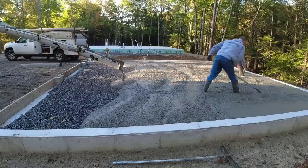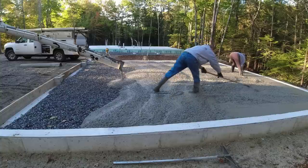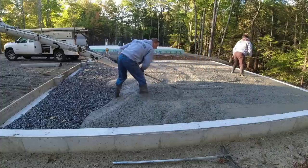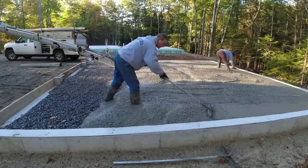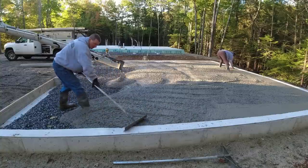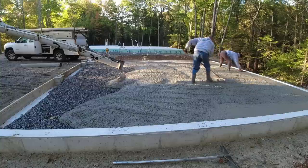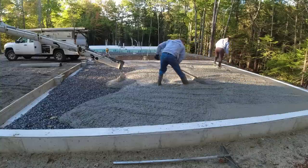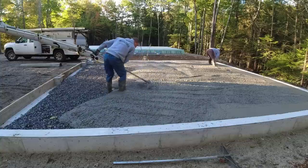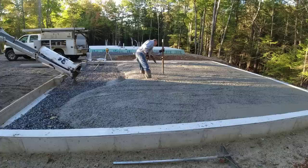I'm getting about two-thirds of this poured out before I screed it. I want to make sure I have enough poured out so I can get the first half screeded all at the same time without having to stop. Once I dump a bunch of concrete on the ground, I'm tuning it in with my come-along — a lot of you guys call them rakes, it's basically the same thing. I'm trying to get it as close as I can by eye to the top of that wall without going low. The worst thing when screeding is having the concrete too low — if it's a little high you can always pull it back behind the screed.